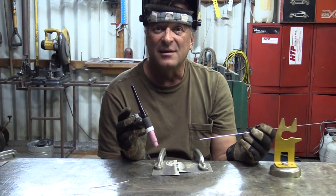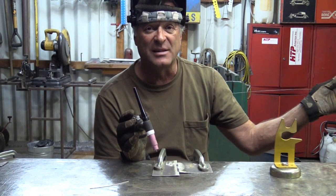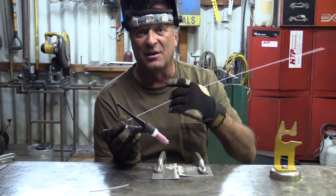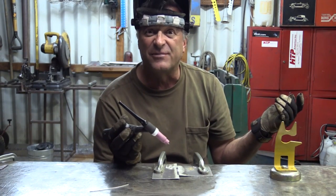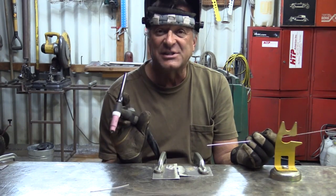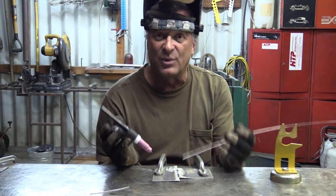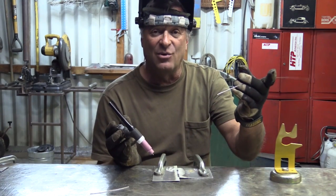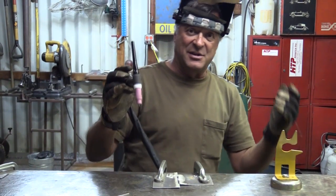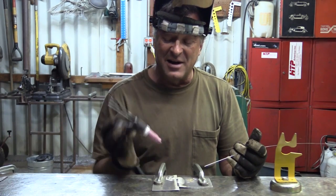What were your settings at? I'm set at 125 max over on the machine. So with the wheel all the way up, 125; all the way down, about four or five amps — turn it all the way down. It functions the same as the foot pedal. We're using it here at the bench, but what I really like is — get out there in the studio where I'm working on something big, standing up or leaning over something. Then I don't have to try to balance on one foot and work a foot pedal at the same time, because I've got it all right here.